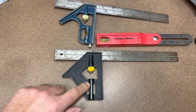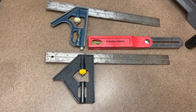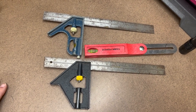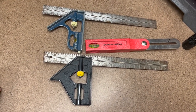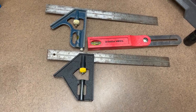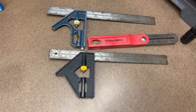These cannot be adjusted, so you'd either want to put a mark on them so you know not to trust those bubble levels, or throw them out. I wouldn't have much hope buying a new one and expecting a lot of accuracy, especially when they're molded out of plastic nowadays. Their main purpose is something other than a level, so I'm not really worried about it - I rarely use them - but I'm definitely going to be putting an X over these because they're just not trustworthy as a bubble level anymore.